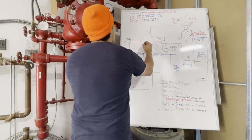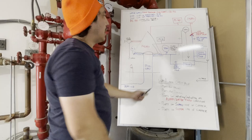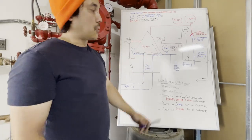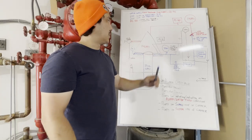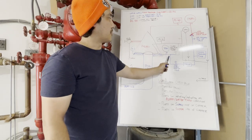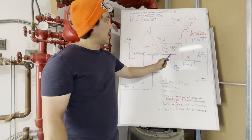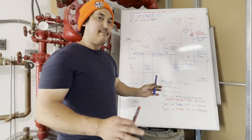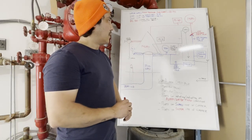There is 140 PSI on my system. We have a water supply gauge that's just going to be reading the underground supply pressure at all times. In this case, it's a municipal source — city water supply pressure — that works for this application. I've been using blue on the diagram to always represent constant water supply pressure. We've also got one valve on here which is normally closed — it's called an alarm test valve. The black piping represents atmospheric pressure — nothing is pressurized under normal conditions.